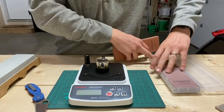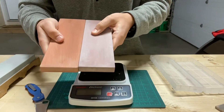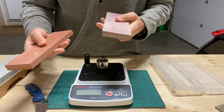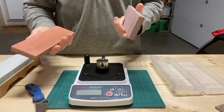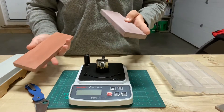So I sharpened it on the 800, went to the 3K, and it was just alright. I felt how it was quite a bit glassier due to that high hardness, quite a bit slower, but the edge I got on it was kind of like — eh. I wasn't really loving what the 3K was doing on there.